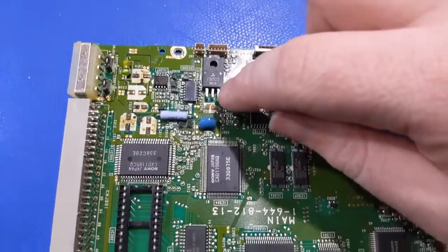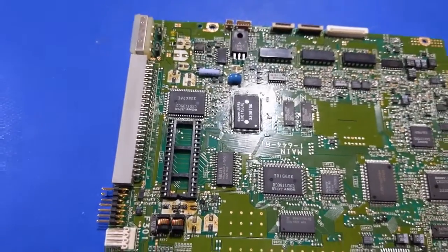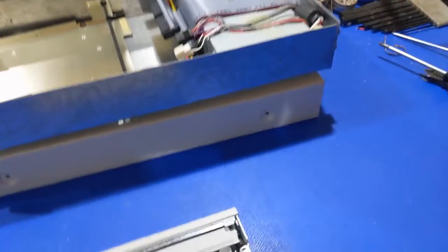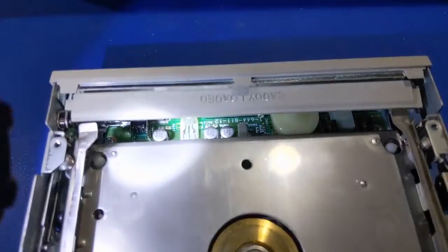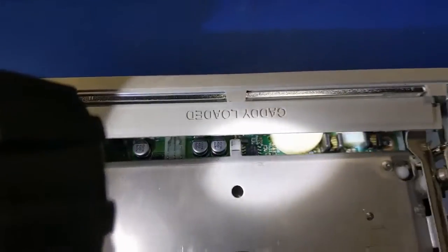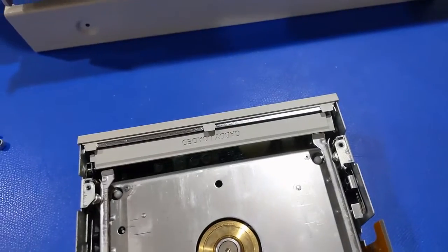This goo has gotten up in between the chips here, it's pretty nasty. So that board is now being cleaned and dried. The next thing is we need to get to the other board down in there because there are our good old friends — you can see one of them is already corroded. So that audio board has got to come out and get cleaned.